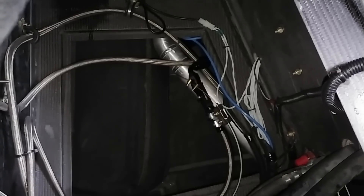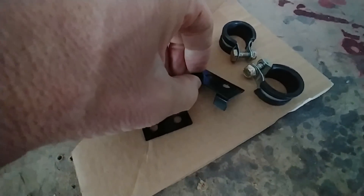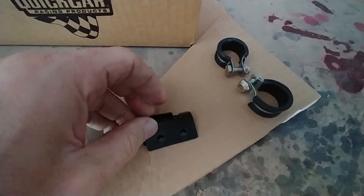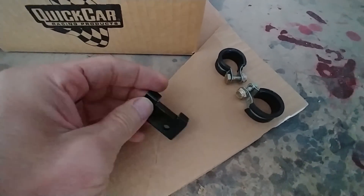I've got the inside rod there just bent to go through that lever with a couple of locking things on there. The next thing to do is just paint those brackets — painted them in gloss black, the usual rattle can stuff — just so they won't rust because that's 4130. And when I get a chance, I'll get that installed again.